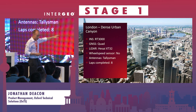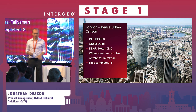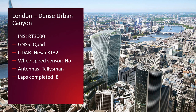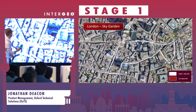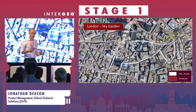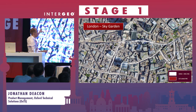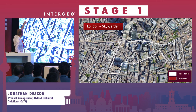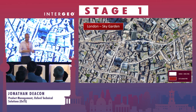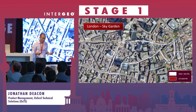Here's where I live in London. It's got a lot of buildings and very narrow streets, and the GNSS coverage is particularly poor. I'm going to show you a data collection we did with one of our INSs - a quad-constellation INS coupled with LIO running through a Hesai XT32 - doing eight laps around the City of London. This white trace is what a loosely coupled GNSS and IMU combination produces. We can maintain position well by Bank, but past the Gherkin we start to drift by meters. For a mapping application, this is unusable.